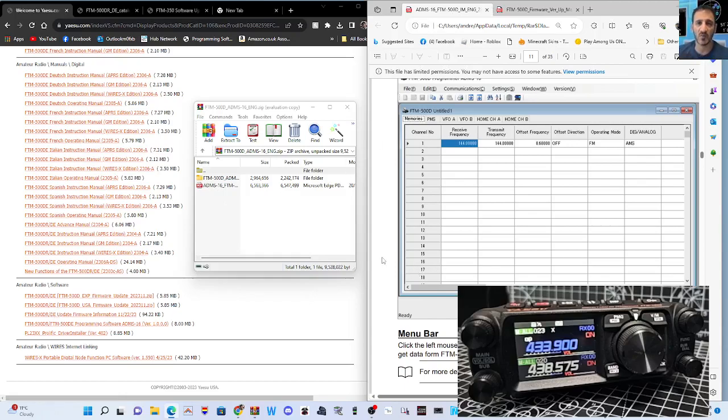Now what I have done is I put the SD card, which goes in on the right hand side just there where you see my finger tapping. So what you want to do is hold down the function button or the big knob on the top right. Turn using the bottom knob until you see the word SD card at the top. Then you get to menu 107. Press that, and you want to do this before you load any firmware as well. Go to write to SD card and select write, and then all. Turn to the left and click OK.